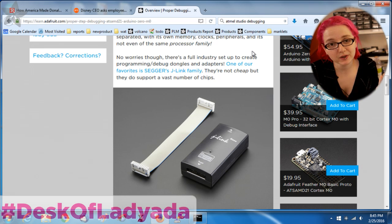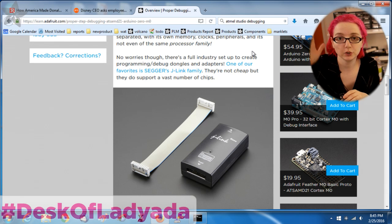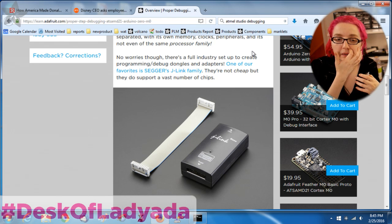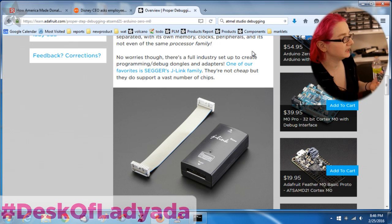But this is still better than nothing, and for some of those things you would use an LED or GPIO toggling, because you can do that pretty much instantaneously compared to this. But it's still a really, really good way to understand, debug, and modify your code and watch the variables. Especially if you're parsing or reading from a sensor, you can look at every computation as you do it. So I think this is kind of neat.